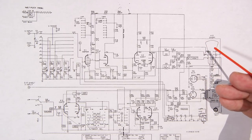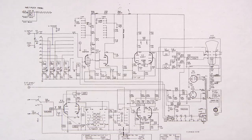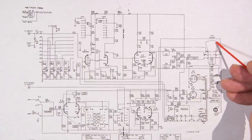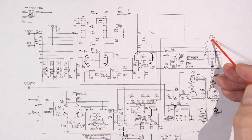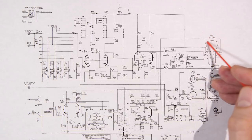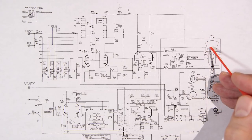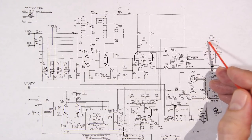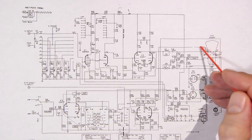And you know how we see a line on the oscilloscope screen? Well, that's actually a dot moving so incredibly fast that it just looks like a line is being drawn across a CRT. And of course, depending on the type of phosphor that you have in the CRT, in this case it's a P1 type phosphor. So it's a very fast phosphor inside this. I'll get into determining the numbering and the coding system of vacuum tubes and CRTs here in the future as well. So again, P1 phosphor, very, very fast. Basically, as fast as that dot can chase across the screen, it's disappearing.